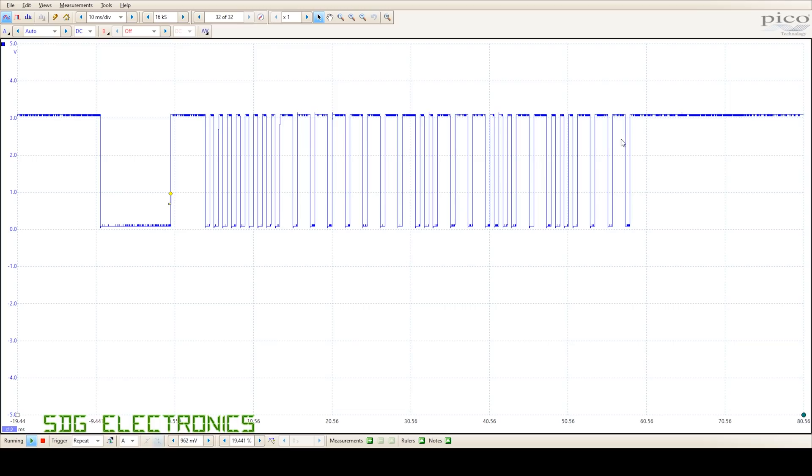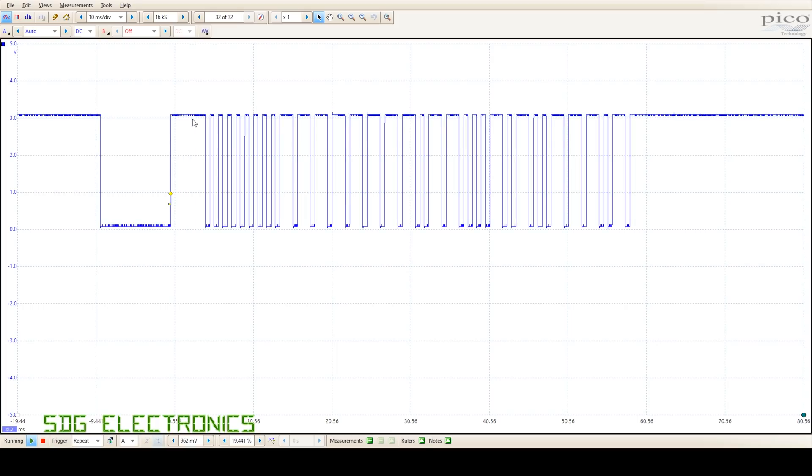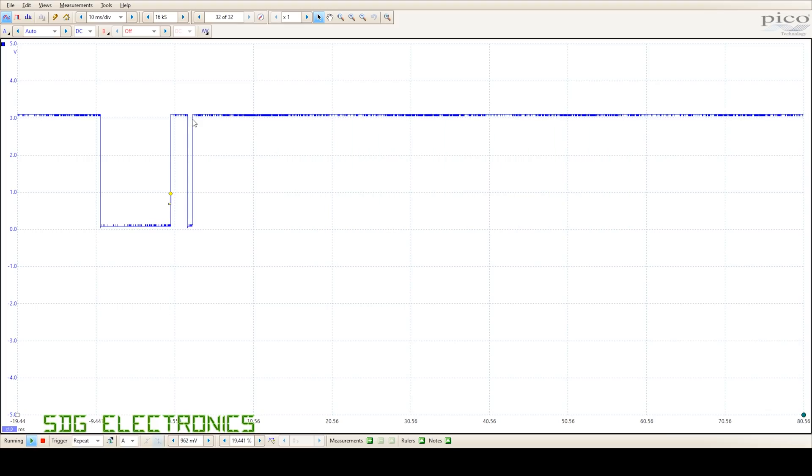In the firmware we can then use the remote control. Sometimes the oscilloscope captures something different — just the nine millisecond pulse followed by the blanking period and a very short pulse — which means you're holding down the button. If you hold down any button you get that same repeated pattern, and you can use that repeat character to detect when someone wants a repeated action.